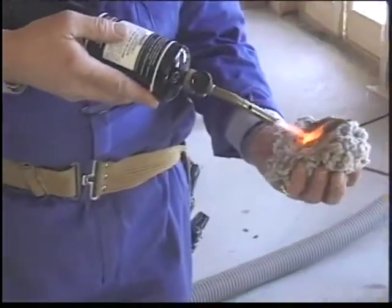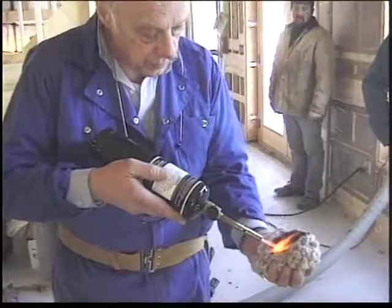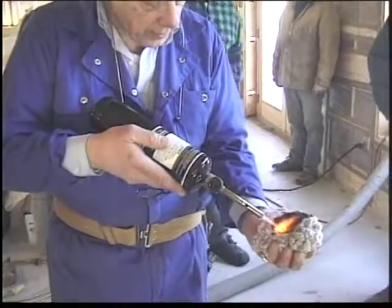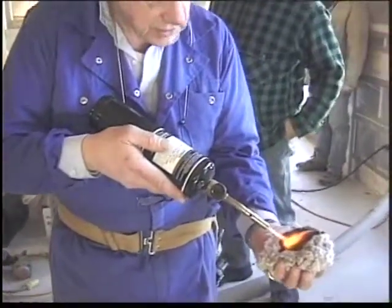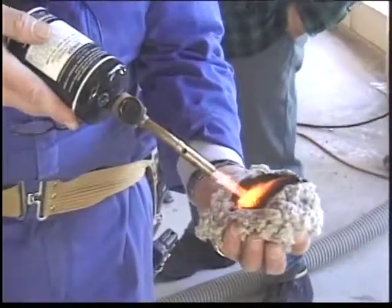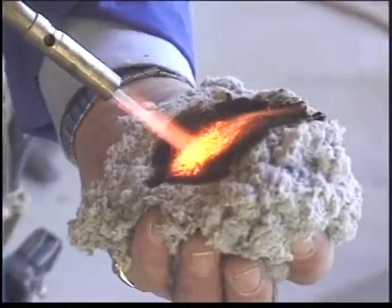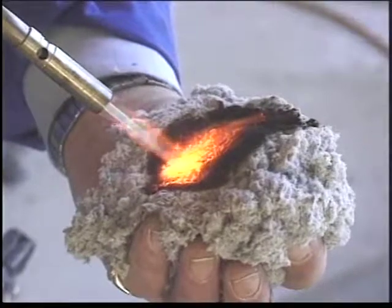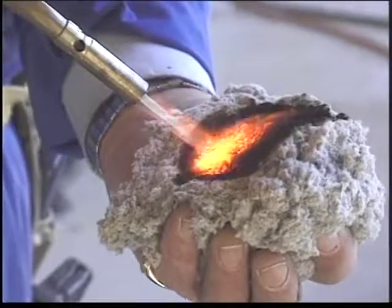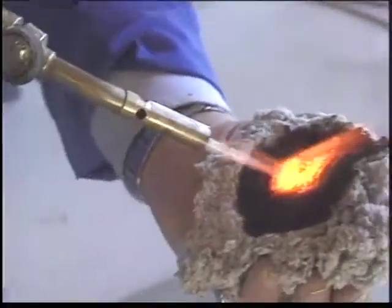The new process of making the cellulose insulation is called fiberization. Years ago, this was done with a hammer mill. And in the hammer mill, it would drive the material, the recycled newspaper, through screens that left visible pieces of newsprint. The old joke in the industry was you could reassemble your Sunday newspaper if you had some patience. But with this new system that I was involved with the development of at a company called Haybuster in Jamestown, North Dakota, a number of years ago, we developed the fiberizing process, and you can actually see the fibers.